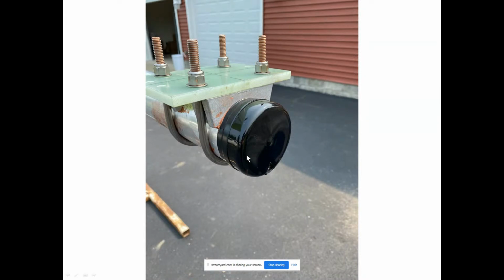And on 3-inch tubing, it's important to use end caps. But on the elements, I never do, because again, I want the water to always get out of there. Right. And water will get in there. I don't care if you seal it up. There's air in there, and air, there's condensation, right? You pass through 32 degrees and you're going to get water. But another good shot of the boom.